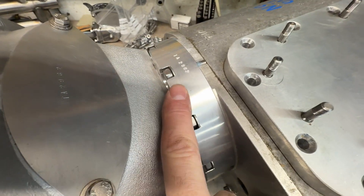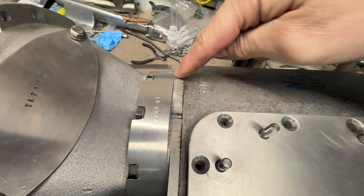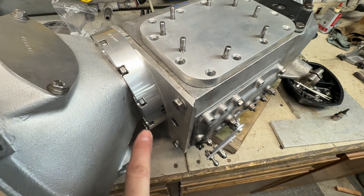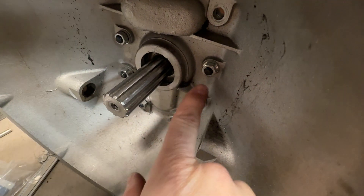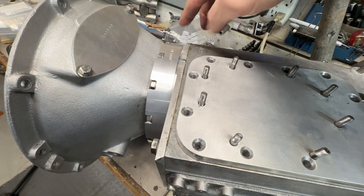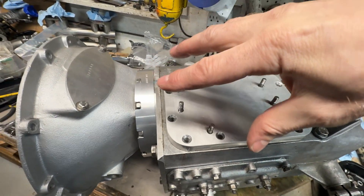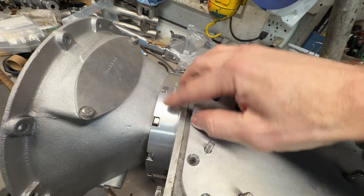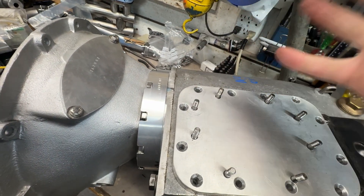You can see how this all goes together. Here's the adapter plate — it has a set of studs laid out on a clock pattern, and those studs go into the transmission casing on this end plate, which allows us to bolt this adapter to this. Then coming the other way, there are studs that come out of that aluminum adapter going the other direction so we can attach the bell housing to this. The reason we need an adapter is because there are bolt heads and other things sticking out of this transmission that don't allow this to sit directly on this surface. There's also a big boss down below — I think it's part of the bearing seal and maybe a drain back area — so we needed this plate to give us that distance. The plate is mostly hollow on the inside with a rim of thick material around the edge where the studs are, which allows room for all of those other things that stick out of this plate.